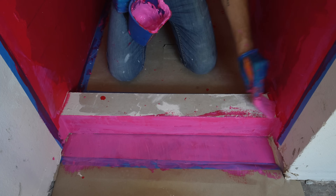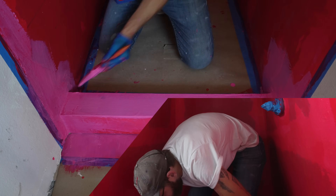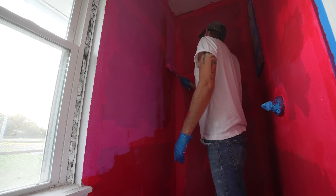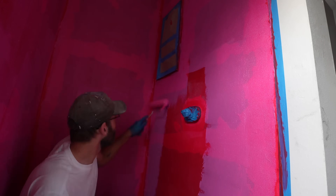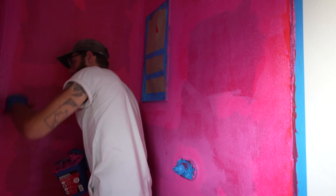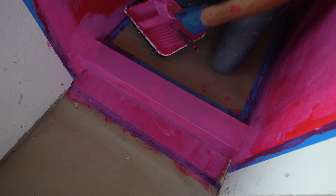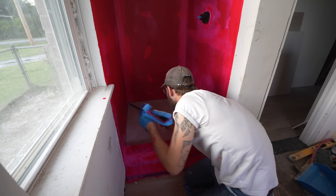I've also seen people spread and smooth this with a V-notch trowel — that's a way of getting a really thick first coat, but I prefer a roller because I paint stuff all the time. I applied a little strip of Redguard to the subfloor in front of the shower — totally not necessary, but not a bad idea. I waited about an hour and did a second coat on everything. On the second coat, the fiber cement board didn't soak up nearly as much. In total, I brushed on three coats to all of the interior corners and four coats on the curb. Quick tip: peel your masking tape before this cures, because it turns into a rubber film that's pretty hard to peel the tape away from.